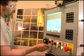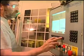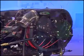I really like the machine behind me because you told me it does the ETX cat, which I'm really interested in right now. Well, how does it work? Basically what it does is the machining on the ETX cat manifold. It machines the surfaces that we bolt to the engine. It drills and taps all the holes for the sensors and the bracketry. It also does the insert for the catalyst. That's a very precision machined item. We have to be sure that it's the right diameter and that we have the ring cut correctly where the snap ring holds the catalyst in place.